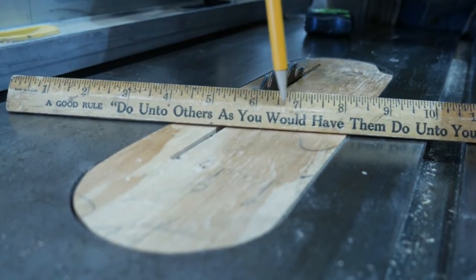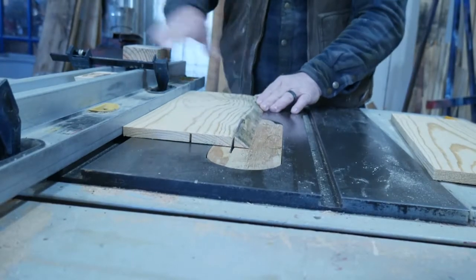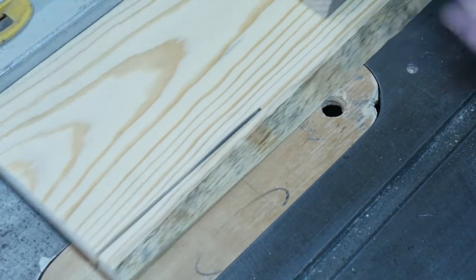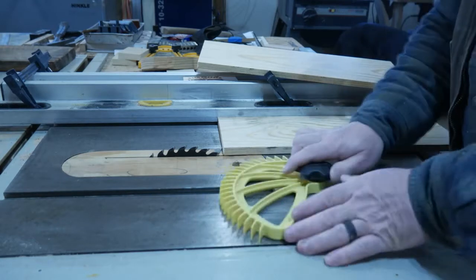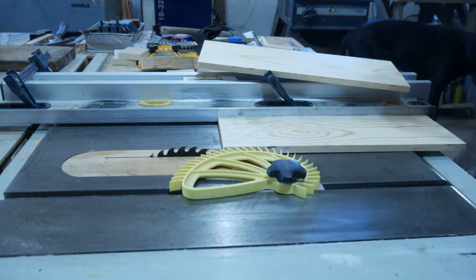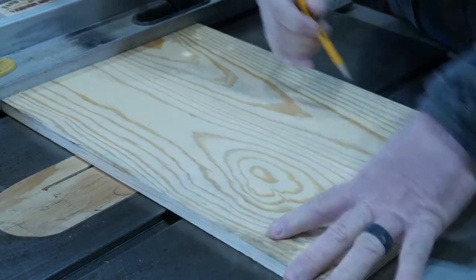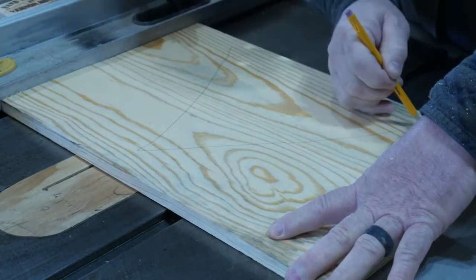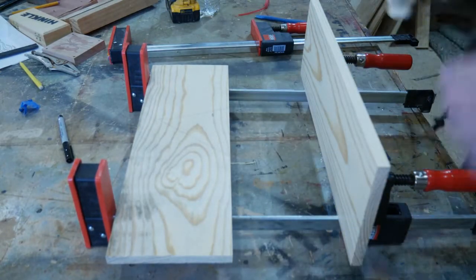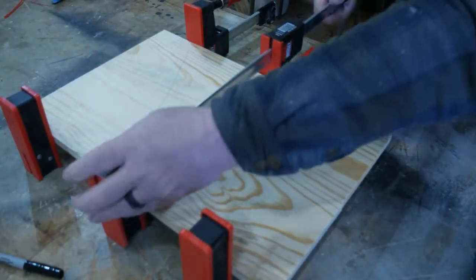Please like and subscribe. Here I'm taking the edge off these pieces of wood - they came from a pallet or crate. We're using the hedgehog to make sure I have good contact with the fence. The reason I have that level clamped to my fence is to increase the length of it. These boards were a little bit cattywampus, and if you keep one edge along that level until you're done with the cutoff you'll get one straight edge you can flip over and cut the other way.